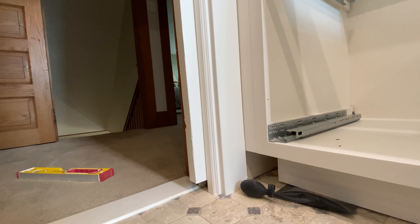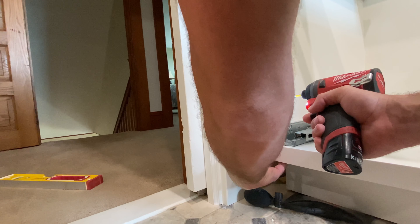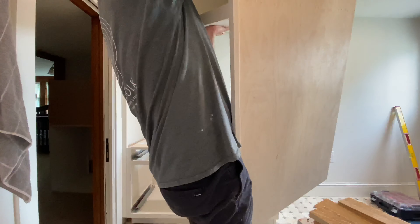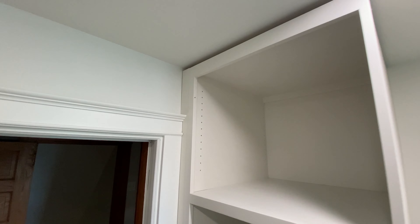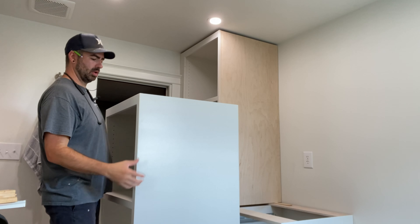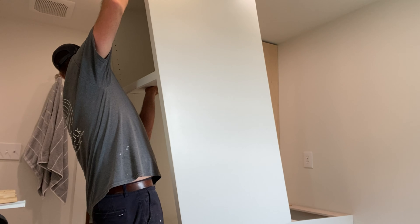I try to keep my screws in places where they're not really going to be seen — this one is behind a drawer, so you're never going to see this screw unless you pull the drawer completely out. I got the filler strip fastened to the cabinet all the way down — it's looking good. Now it's time to pop the second upper in and it looks like this is going to line up great. My trim piece at the top aligns well with the lights. Always fun being a one-man show — let's lift this one into place and try not to hit the ceiling.